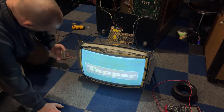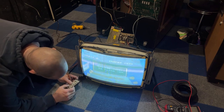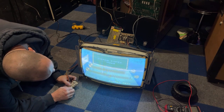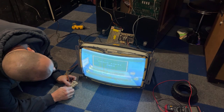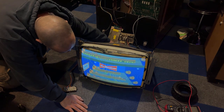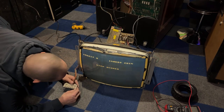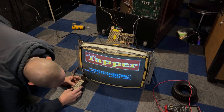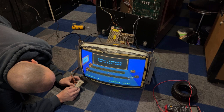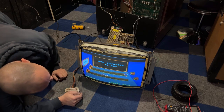First thoughts — let's get it to stop scrolling. Let's see what we got here. Vertical hold. Flyback's up too high; we need to lower the flyback. So let me turn that down. Okay, that's looking good. We're getting rolling on it still. I almost wonder if I have to hook up another sync wire — I wonder if this requires two sync wires, because it's kind of jumping back and forth.